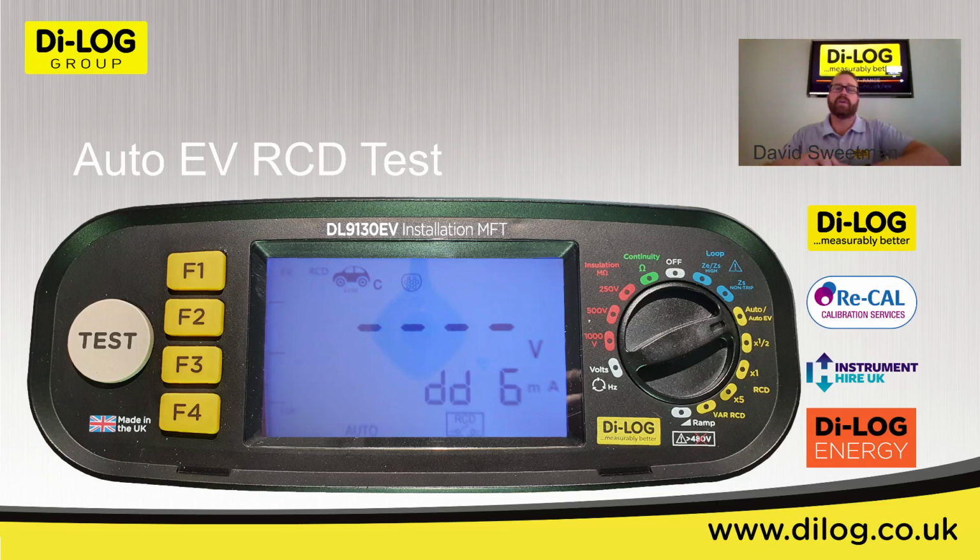However, if you've got a 30 milliamp, or a conventional system which is earth stake, or a Type B RCD in there, you can just press F4 and that will switch it to a DC 30 milliamp test. But we're looking at 6 milliamps DC, and what we're looking to do with this is actually run a complete testing sequence. We'll check the DC side at 6 milliamps on the EV charger, and then we'll run the AC tests through the Type A RCD on the sub-distribution boards, and at the end of it we'll have a complete sequence which we can recall on the tester.